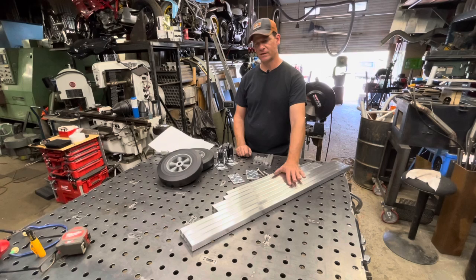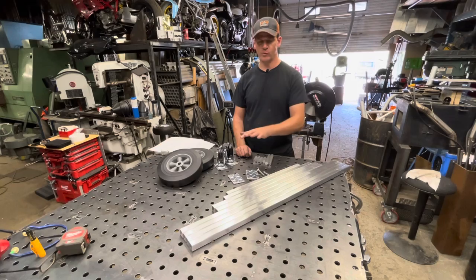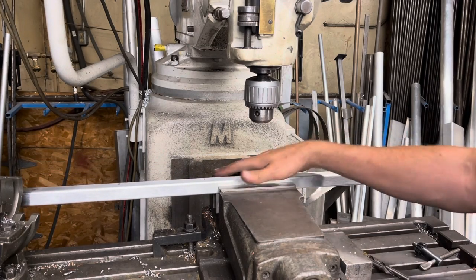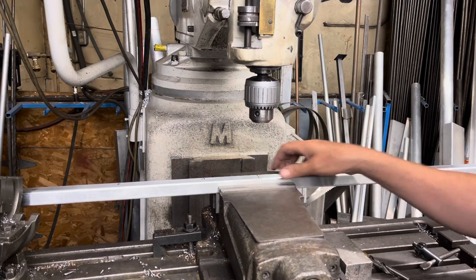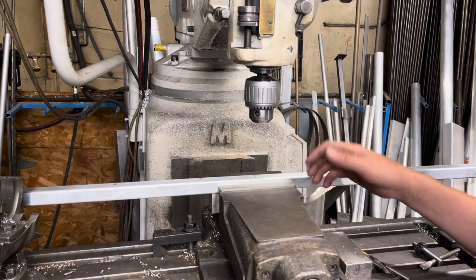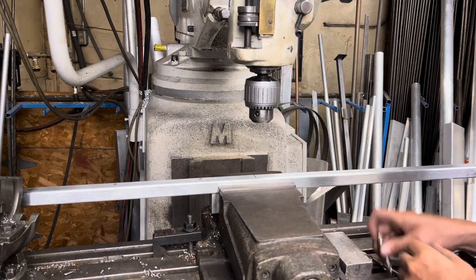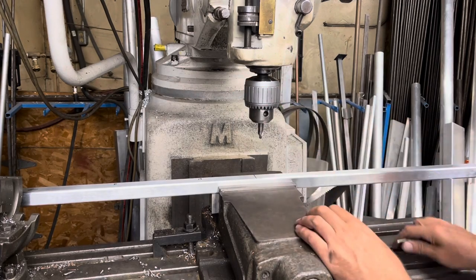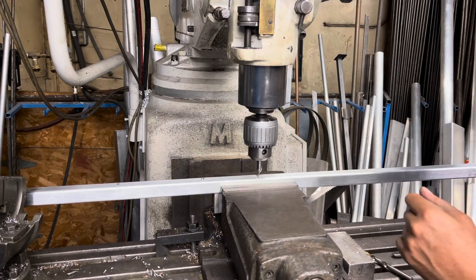I have to drill a couple of holes in these longer uprights, but it's just about ready to put on my fixture table and start welding. Now I'm going to start drilling for the pivot bolt. I have it in my milling machine. Not everyone has a milling machine, but this can also be done on a drill press — you would just scribe out where the center is. I picked up center here and now I'm going to put in my center drill, which will make sure that when I actually drill, it's going to follow right to the right point.